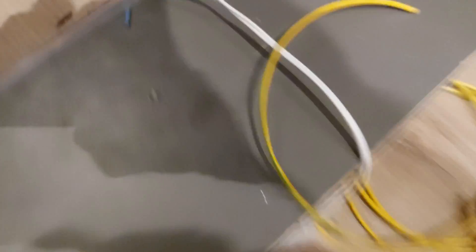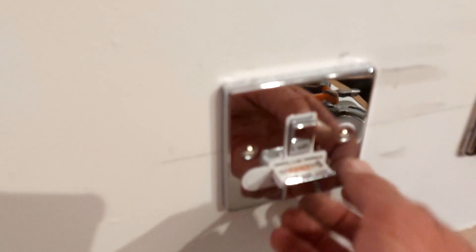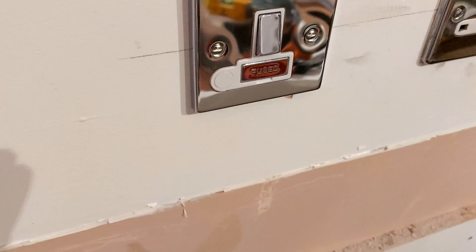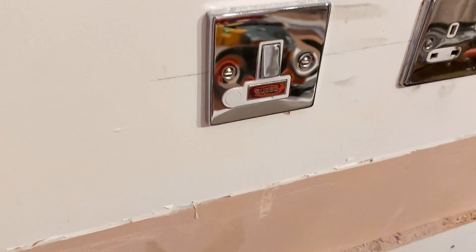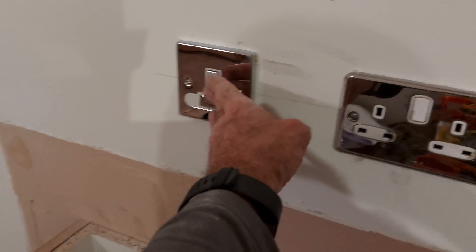Let me just take that sink off. Got a fuse connection unit in — flying cable, I'm going to click that. This is important — I've used one mil cable. That's all the load is. I've got two and a half mil supply in it but one mil on the load side, because that's all I need — it's supplying some plinth lights. So change the fuse to the right size. You see that too often where it's the wrong size fuse. Plinth lights done.